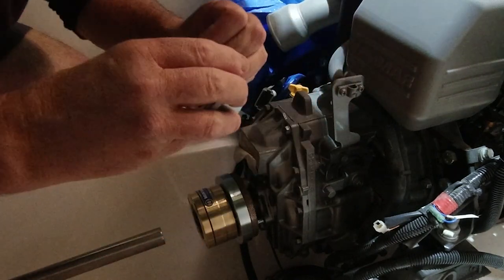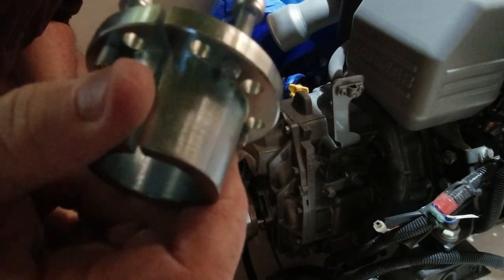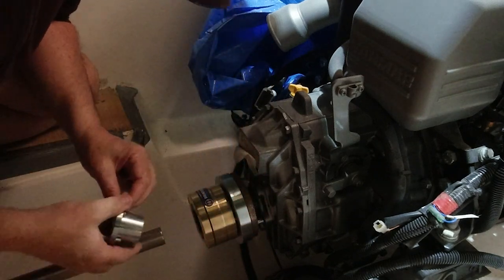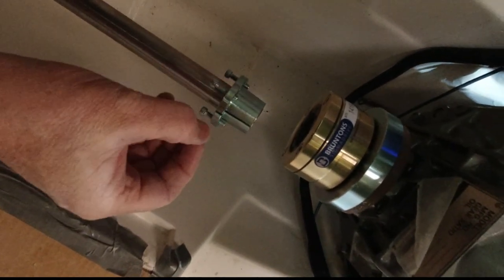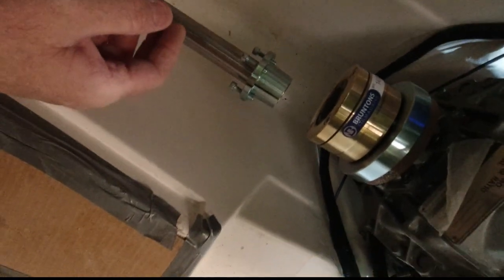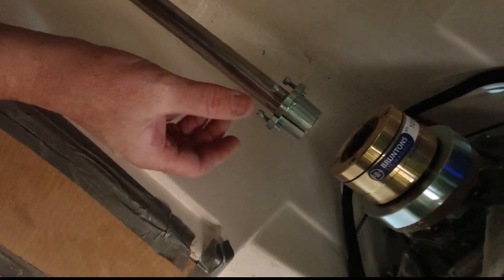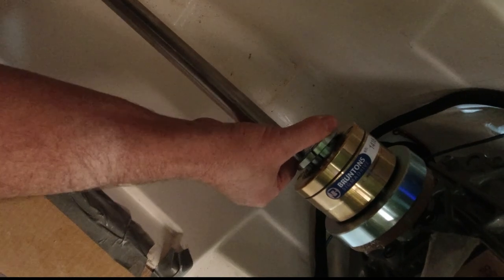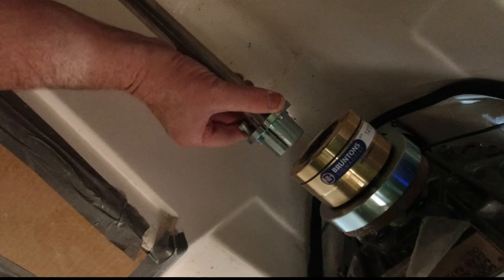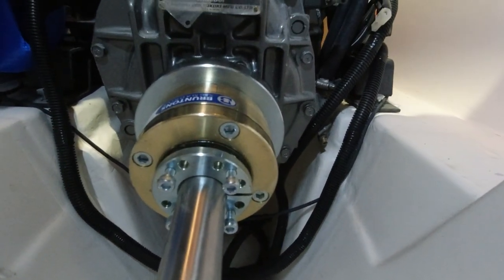Now, the second thing we have here is a tapered insert instead of a keyway. How this works is that it has a small split in it, and as it's tightened, it physically clamps onto the shaft. So there is no physical keyway on the Brunton Sigma drive, and that basically fits, and then that slides over the top. As the unit's tapered, as it enters there and is tightened up, it physically tightens on the shaft with no further keyway required. Once again, we're eliminating problems with keyway slippage and obviously wear and tear. And the movement that is then allowed within the actual Sigma drive is quite substantial. I think it's up to 3 degrees on each side, allowing for vibration and slight misalignment, which can happen with these things when you've got engine mounts wearing, and this cuts down on fuel consumption and vibration within the motor.